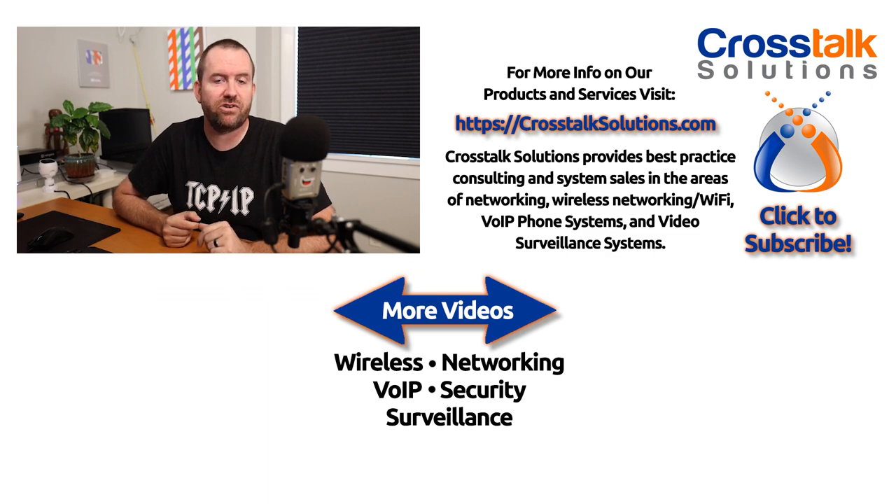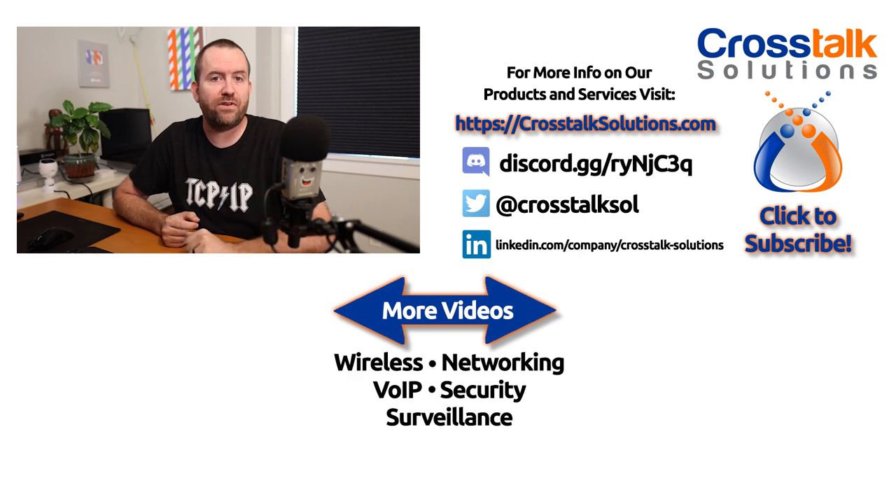There you go — that's the G4 bullet compared to both the G3 bullet and the G4 Pro. Personally I really like the G4 bullet. If you're putting it on the front of your house, I'd recommend getting an external IR illuminator and setting the G4 bullet to automatically switch to nighttime mode without using the onboard IR lights — you'll get a much better, clearer picture that way. One IR illuminator can also serve multiple cameras depending on placement. Links to everything including the external IR illuminator are in the description. I'm Chris with Crosstalk Solutions — thanks for watching.